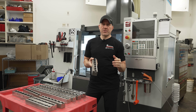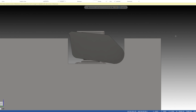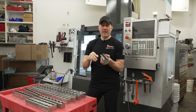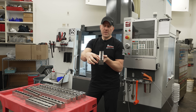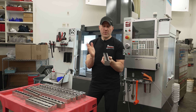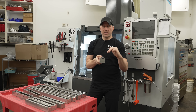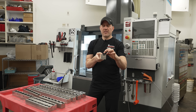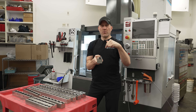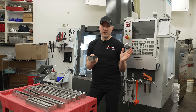When you cut the channel for these clamp rails or the clamps to go into, they have a little radius on the backside of them and they pivot. When they pivot, they push on the back wall, which starts to wear out and push back. A lot of people will put a steel backer or leave these heavy and cut them back to clean them up, but that changes where your throw is - and that's a big problem. What I do is put a radius the same size as the clamp itself. Don't use a sharp corner in there. That way it's pushing all that material to push back versus one point of tangent. It's going to keep your clamp rails running forever. I've used these so long and they're still perfectly fine with the same clamp pressure.